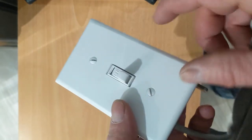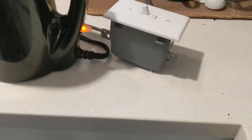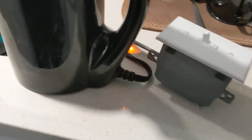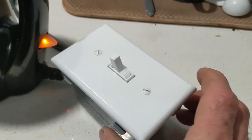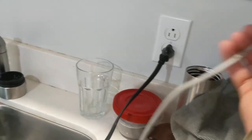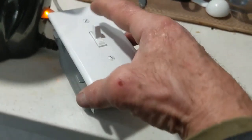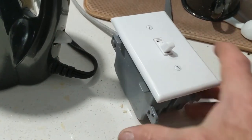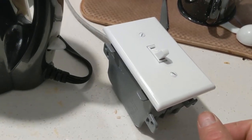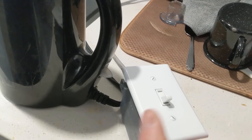But I can show you a test just in here for you guys to see in the office. Let's test this guy. Like you guys can see, we're boiling some water in here. Look at the light — the light is on. Here's my tester, I'm just gonna plug it in right there. I plug it in, my water is still boiling, but then I'm gonna switch it on — look at this, pay attention to the light of the water — bang! I could hear the breaker just going down. This is how it works. Now I can go there and see which breaker it is, and I can label it.